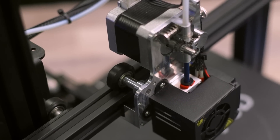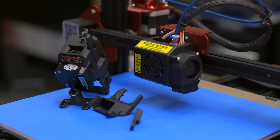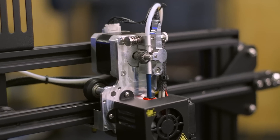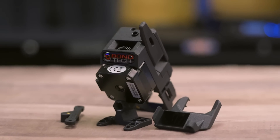Many of the more affordable 3D printers hit their price tag by using hardware that works well enough but doesn't have any bells or whistles. Micro Swiss and Bondtech produce their own extruder upgrade kits that include everything you need to change over to a more advanced extruder — no soldering required. Both manufacturers use dual drive gears to grip the filament from both sides to maximize torque and adjust tension so soft filaments don't squeeze out from too much pressure. Micro Swiss uses machined aluminum while Bondtech uses SLS 3D printed nylon as the base components, allowing them to easily change and improve their designs from one printer to the next.